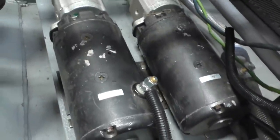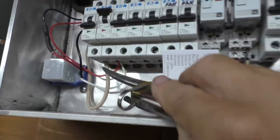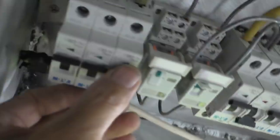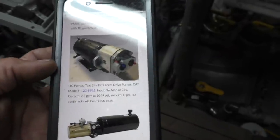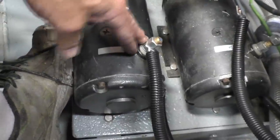That's not good. I'll have to take the motor off and see if it just spins without the pump on there. We found a 40-amp breaker back here, so we're going to borrow it. 40-amp breaker's in now — nope. Well, that's not good. 40 amps isn't enough. We've got something wrong with that motor. Right there on my side, I say it's a 36-amp, 24-volt pump.